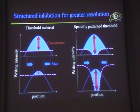It's not that exciting. So let's go back to this chart, which I just stole. I think I've used it three times now in this lecture because I'm lazy. You can play this game. If you could get some sort of threshold, you can have a threshold that I've been talking about chemically. There's other thresholds you can invoke in lithography. And if you pull your optical exposure so it's like an island just poking out of the sea, then you can make a transversely smaller spot. But the penalty is you don't get to do a lot of chemistry, whatever the chemistry is you're doing, in that spot. And as you try to go significantly below the optical diffraction limit, you start losing in a hurry. It doesn't work too well.